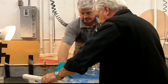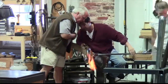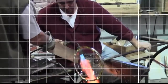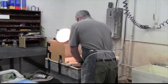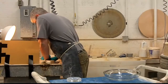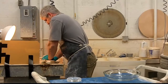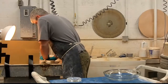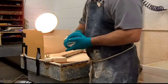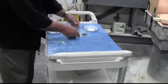I definitely let the younger people check these surfaces — even with readers I say, 'Oh wow, it looks great,' and under another kind of examination there are a myriad of fine scratches. So I let the young eyes do the inspecting and know when they have to go back on the pad. The finer the grit goes for polishing, the more suction it has in terms of pulling the piece down to the surface, but it also makes it more difficult to pick up — and if you pick it up on an angle you start to lose flat. When Rob says 'pretty good,' it's good.